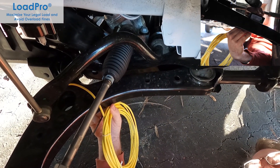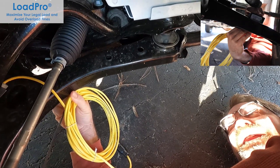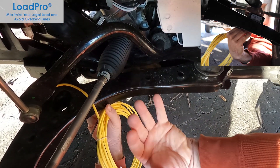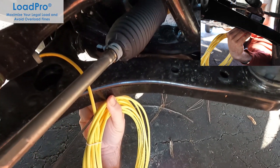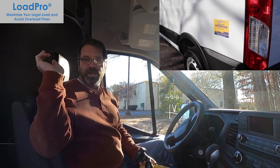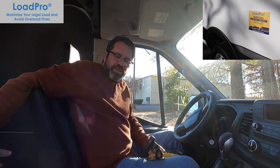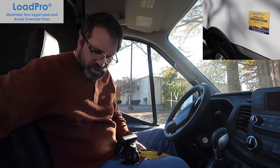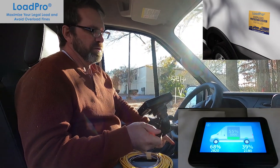The good thing is we've done over 20,000 of these systems worldwide, so our engineering team has a pretty good idea of which part of the suspension will perform the best. So that covers the front. We've got two on the rear, do the other side the same way. All wires run back to the junction box, and from the junction box up to the meter. We calibrate it empty and calibrate it full and you're protected against overloading. For the last part of the install, we've got sensors in the left rear, right rear, left front, and right front, junction box in the middle underneath, and a cable that runs from the junction box up to plug into the meter.